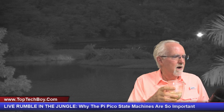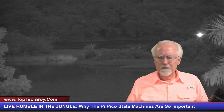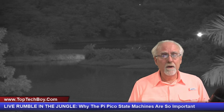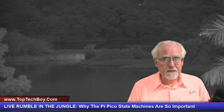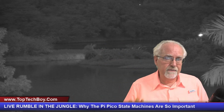Okay, so it looks like we've got a nice group of people here today. And what are we going to be talking about? We are going to be talking about the Raspberry Pi Pico state machines. Okay, what are the state machines? The Raspberry Pi Pico has 8 state machines. And what you could think of a state machine is, it's almost like a separate little core off to the side, but it's a very crude core. It doesn't do very much, but it runs completely separately from your 2 main cores. And so you've got this extra hardware out to the side that you can utilize.